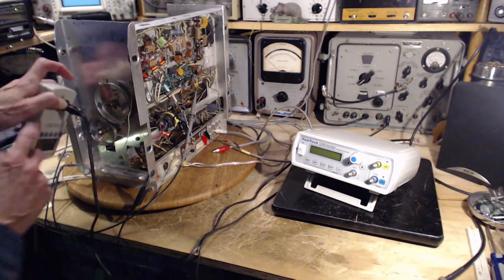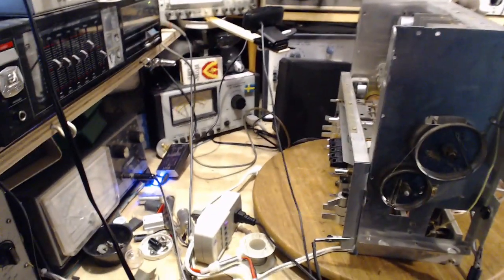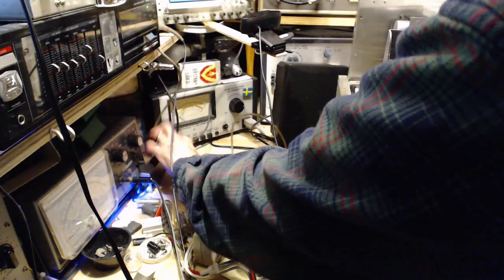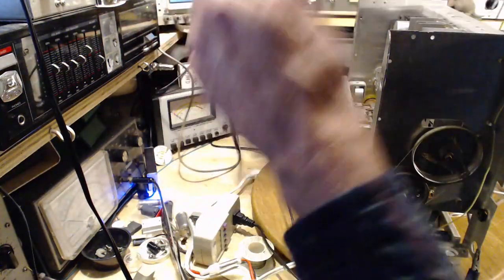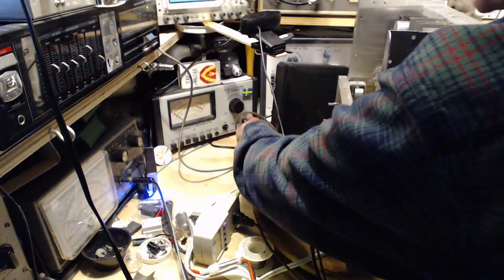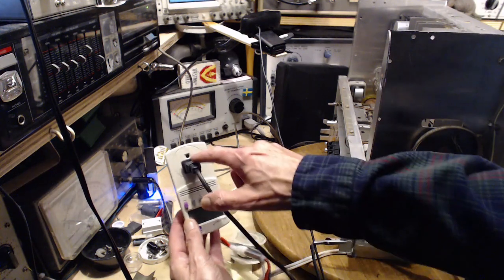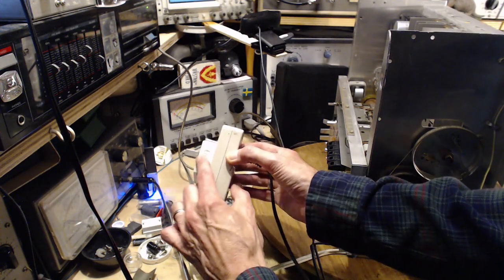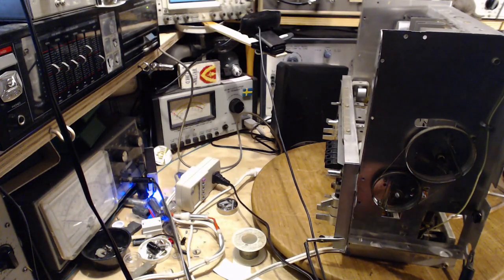In it goes. Now I've plugged it into here. This is being fed, a little bit unnecessarily complicated, through an isolation transformer into this box here, and I'm sorry about all these wires in the way. With this I can control the line or the supply voltage quite nicely, all the way from 0 up to, I think, over 120. It says isolated output here. You can see I'm plugged in with a 3-prong plug, but what finally makes it to my bench is just 2 prongs. So this third prong, don't be fooled, it's just sticking out there. And that's just a 2-prong extension cord. So I'm trying to avoid grounding my projects. Most of the things I work on are 2-prong devices anyway, they're not 3-prongers.